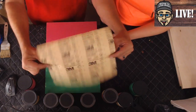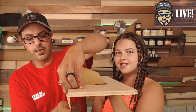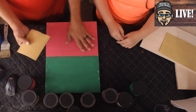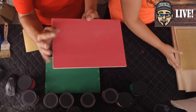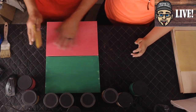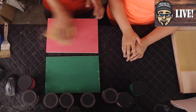These sandpaper sheets come in 9 by 11 sheets — the 3M 320 grit, one of my favorites. What I usually do is fold it in half, find a sharp edge, score it, then fold it in half again so I have two sides to go back and forth when sanding. When the paint is completely dry, lightly sand it. Chalk paint is water-based, so water raises the wood grain hairs up and they don't come back down — you have to sand those off to get a really smooth finish.